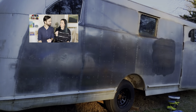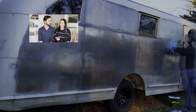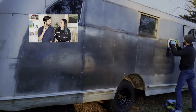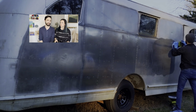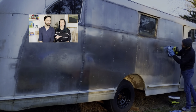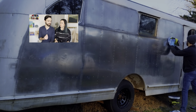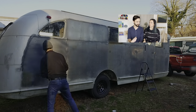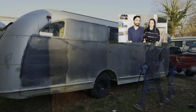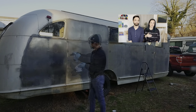There were the fuzzy ones and then the cloths themselves are more of a microfiber cloth. The microfiber cloth was the one that we found the best result with. Originally when we did the one section, we tried sheep's wool cloth and that didn't work out well. You polish until the black residue is no longer on the aluminum — that's when you know that you're done. The sheep's wool absorbs so much of the polishing paste that it absorbed into the wool and didn't apply itself to the aluminum. Maybe someone else has a way around that — leave a comment if you've done this before. We welcome all the rest of the tips before we do the next polishing.